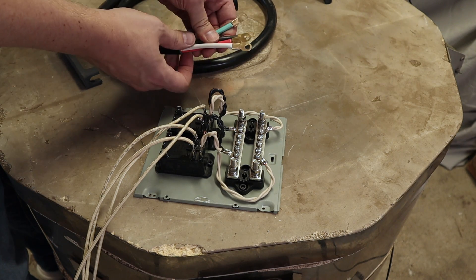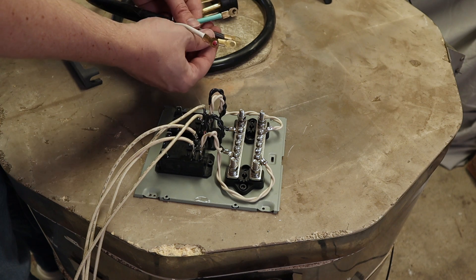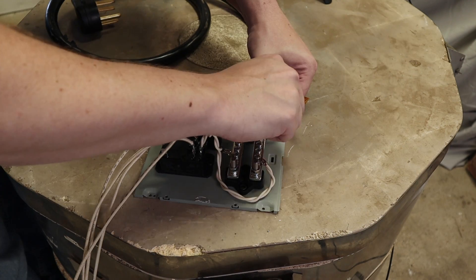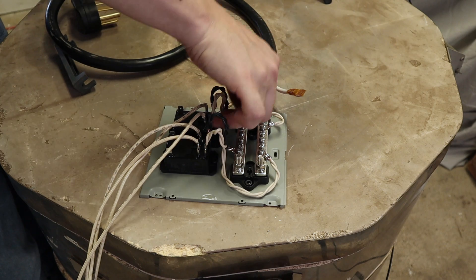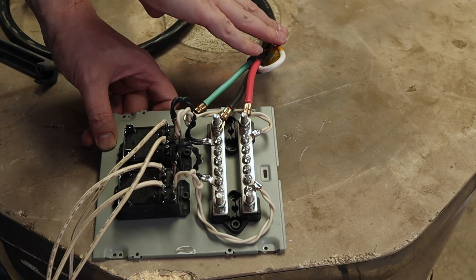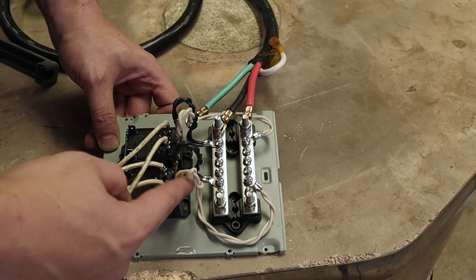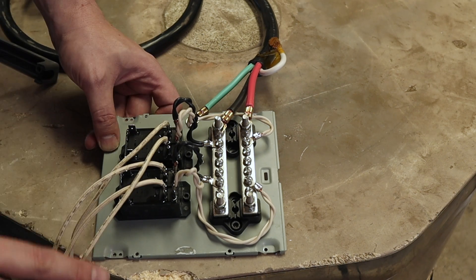The next part of the high voltage system is to connect up the power leads. This is the neutral lead — I'm not going to use this right now. The ground I'll need, along with the two 240-volt lines. Since I'm not using the neutral right now, I'll just wrap it up with some Kapton tape. I've covered the neutral and taped it back. One of the two 240-volt lines goes to one side of the terminal block, the other line goes to the other side. I've connected the ground to the base plate. From the terminal block we come up to one side of each relay, and the other side of the terminal block comes up to the other side of the relay, which then goes down to the kiln.